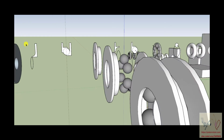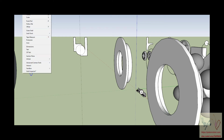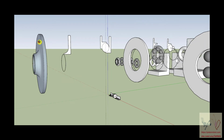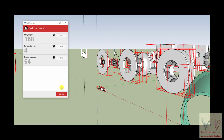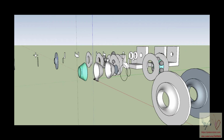And there is a program in SketchUp where you can take a pathway and choose Follow Me, and it whips this around and takes that shape that you just saw and makes that shape follow this pathway. And so now you have this structure here with this rounded off edge to it. And this rounded off edge happens to be the diameter of this ball because we measured the ball. And one of the things that SketchUp does, which it's not clear to me why, but it does, it tends to make stuff inside out and backwards. But you can have the solid inspector fix this so that it turns itself into a normal solid and does not have anything wrong with it.